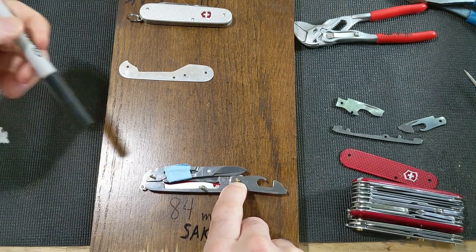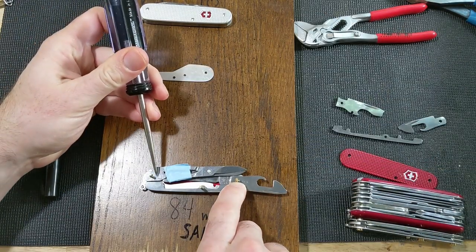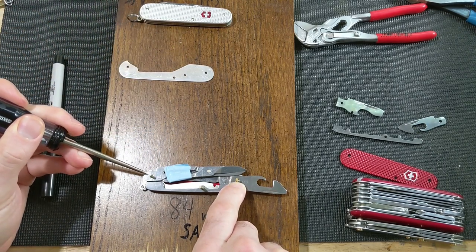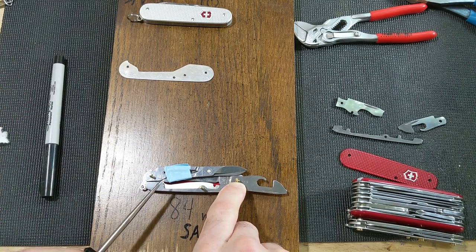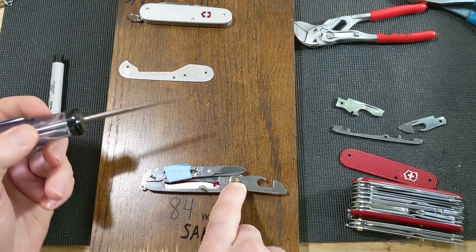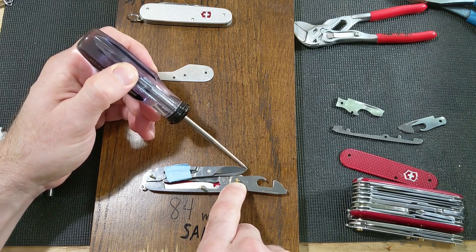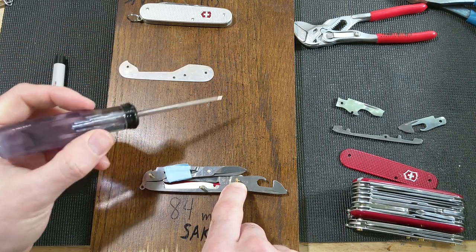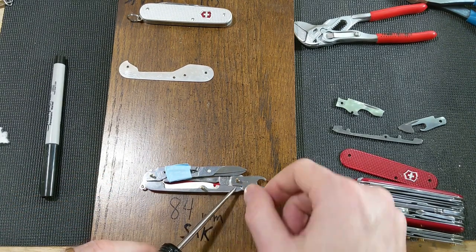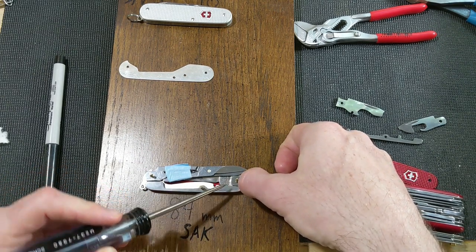The scissors, I'm going to move the hole on the scissors. We're going to drill a new hole. Let me get something I can point with. We're going to drill a new hole right about here, I think, which means I'll then have to grind the back off of this to shorten that a little bit. And then I will also have to take a little bit off the handle so that it doesn't run into this and it can go all the way down and close. I don't think I'm going to have to shorten the scissors. I might have to take just a little bit off, but I hope I don't have to do that. And then I'm obviously not going to leave this can opener here. I'm just going to use this much of it